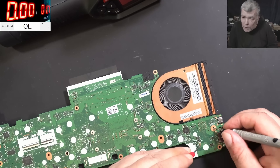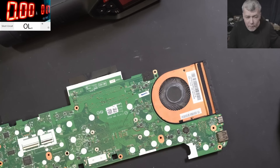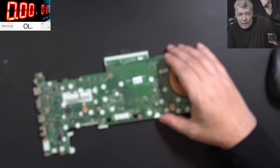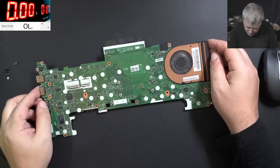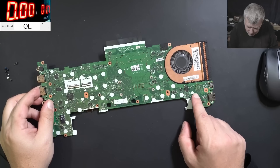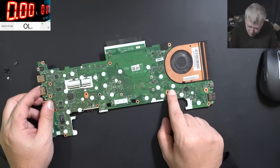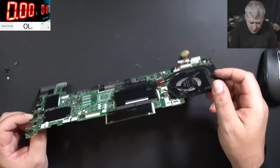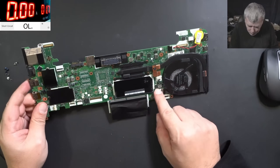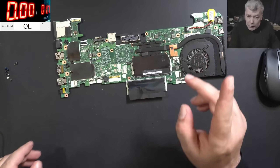The capacitor is removed — do we still have a short? Let's see the power supply. No, it's not shorted. Check here on the fuse — exactly on the fuse, it's not shorted. What a dodgy capacitor! But anyway, the schematic is weird on this board. Clearly this capacitor is on the power coming into the board after those two MOSFETs, but has nothing to do with the main power rail — which is very strange. We found the problem — let's test it.